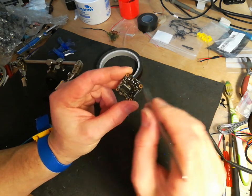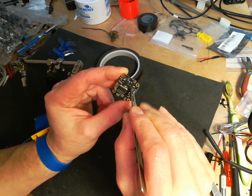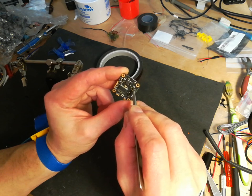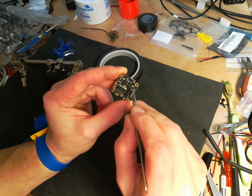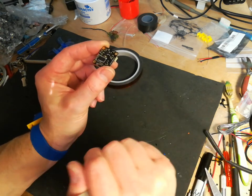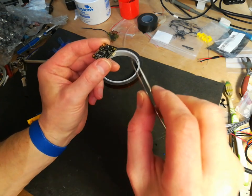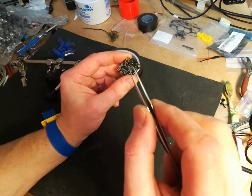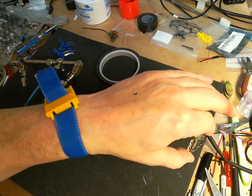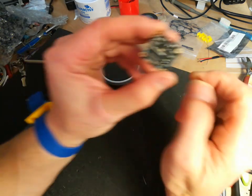And I've done a little bit of testing with it, done a bit of voltage checking and stuff. I've tried to identify the components using the serial numbers, but they must be in-house part numbers. So, well, it's hit and miss. So I've got another voltage regulator here. Hard to see, I know. There we go. And I'm going to change it out.